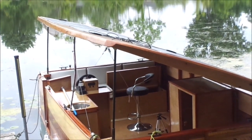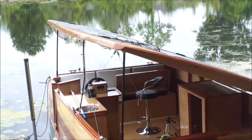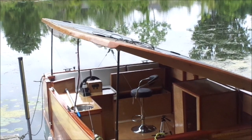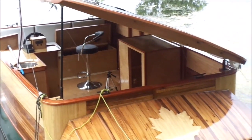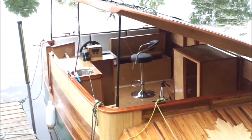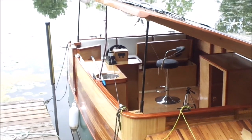20 degrees is about the maximum I can achieve by having the linear actuators powered separately, lowering one side completely and extending the other side up completely. That's still pretty good — 20 degrees. And it is solid.